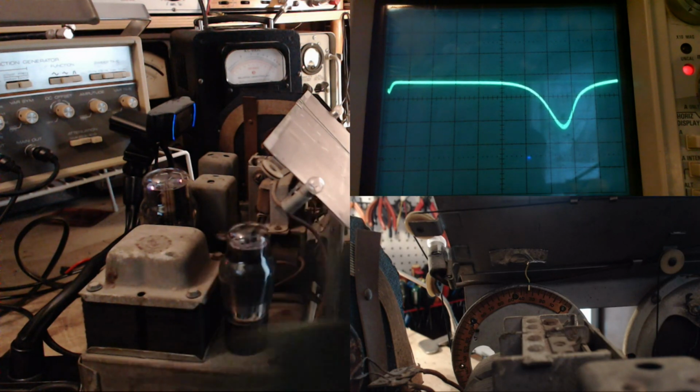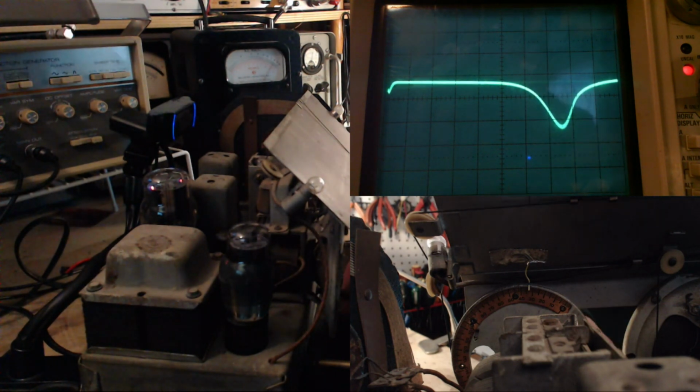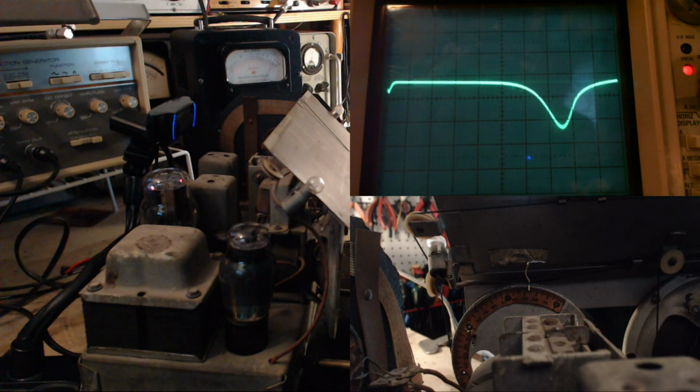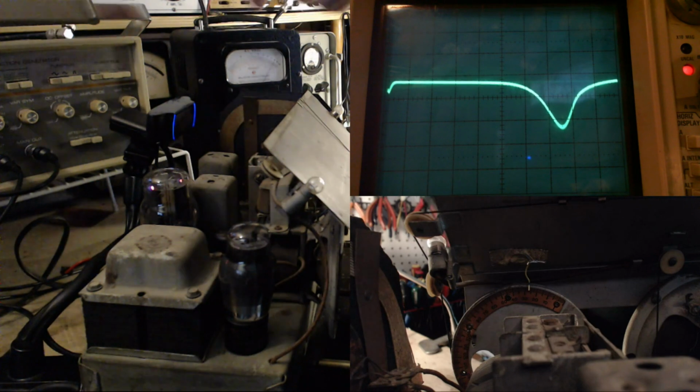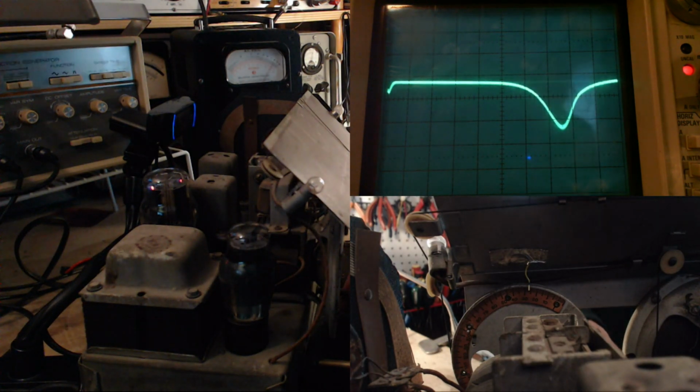So what we want to do is feed a signal in at 1400 and it should be at 27 degrees. So what I'll do is tune the radio to 27 degrees. It's almost there. 27 would be right about there. I'd say that's 27. There's zero parallax in the way I have the camera arranged. So yeah, that's 27. Turn it up a bit.